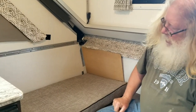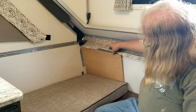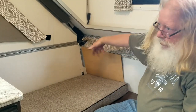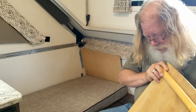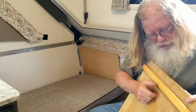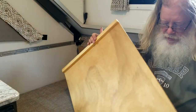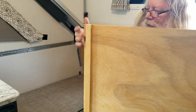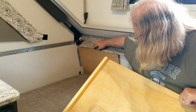The last piece is slightly longer than the distance from here to here — probably about three inches — and this curtain gets tucked down in behind that, resting on the spacer that's there. My top piece is just a piece of half inch plywood. It has a good side to it and it looks good on both sides — a scrap piece my nephew had. You'll notice it has runners put on, glued and nailed with brads, one on each end. The gap on one side is greater than the other: the larger gap takes this up against the front wall of the camper with just a little bit of space to spare.